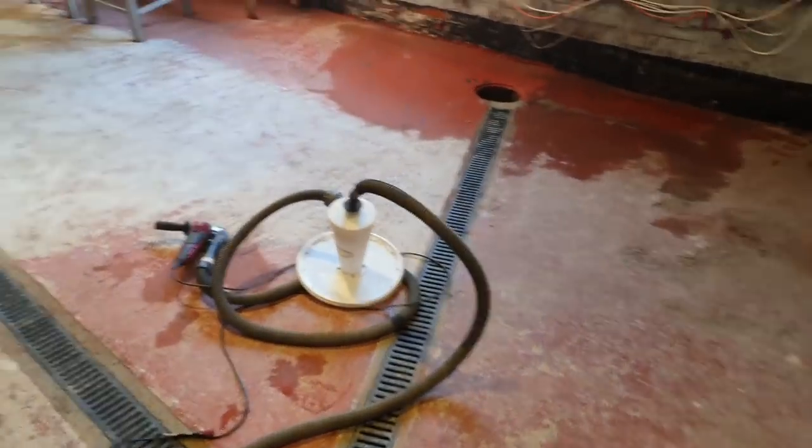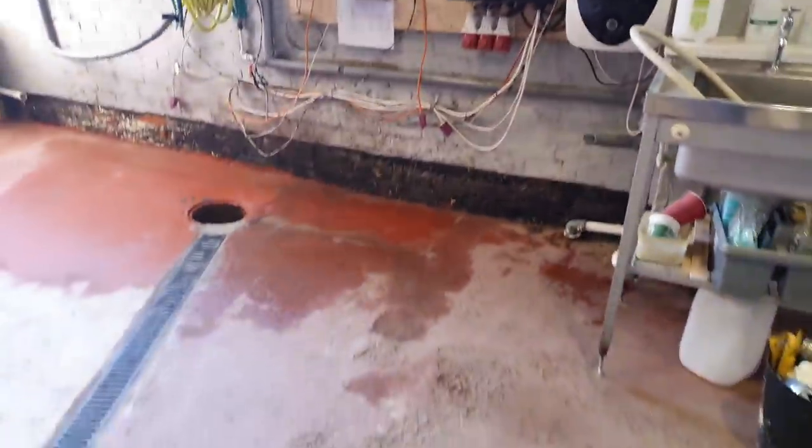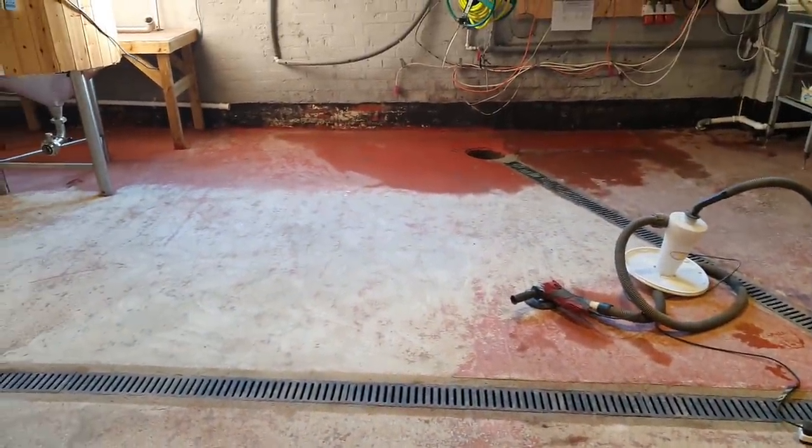I'm just having a break, my back's hurting a little bit. But as you can see we haven't got a lot to go, and I think it's only just hit 3:45. Lost a bit of time there. This section here is going to need some attention - see how kind of eaten away it is with the aggregate exposed. I might be able to shave down the top layer on that section just to give us a nice surface. We had something very similar just here - through one or two of the larger pits. This was really quite bad and you can see we've cut into quite a lot of the aggregate and levelled it out nicely. We're not taking a lot off the surface because you can still see the paint speckles here and there - so it's just skimming at the top, maybe a tenth of a millimetre.